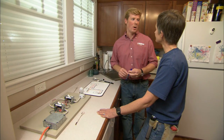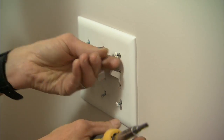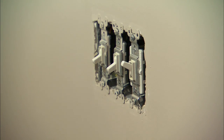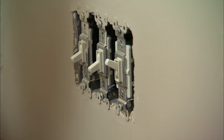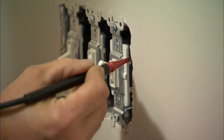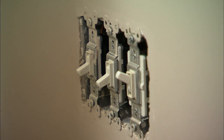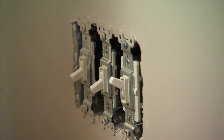So what do we do about our problem? We're going to turn off the power and go test the switch. With the breaker off, take the cover plate off. Even though you've turned off the breaker, always test to make sure the power is off using a voltage tester from ground to all connections. No power — safe to take the switch out. Note that these other switches could still be on a separate circuit, so stay away from them or shut those circuits off also.